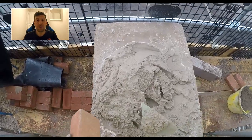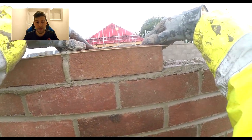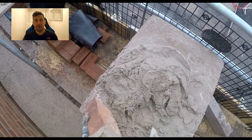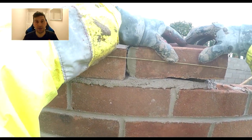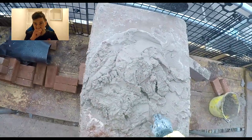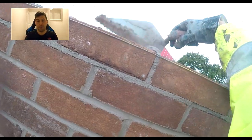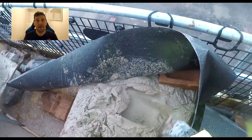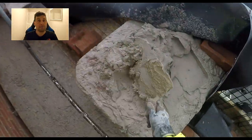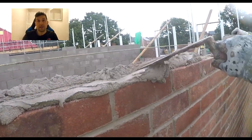What I've done here is spread for four bricks, eight bricks, and then when going to lay a brick you can see what I'm doing — I'm putting a joint on, putting my trowel down, and lifting the brick with both hands, trying not to touch the line with my thumbs. It's not too bad for me because my boards are high so I can just rest my trowel there. If your boards are low it'll be more of a pain, but what about magnetic trowel holders? I've been using one for blockwork — if you had one on your belt for this two-handed technique you could really let rip.